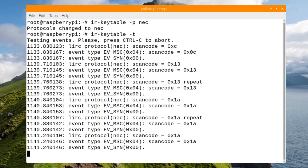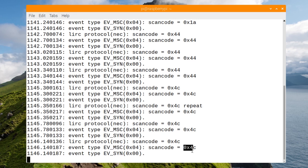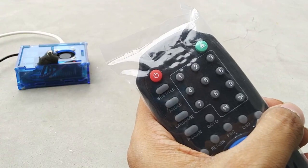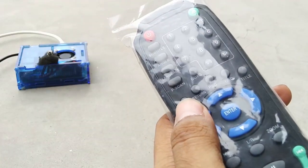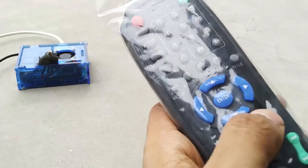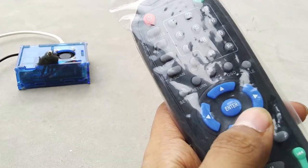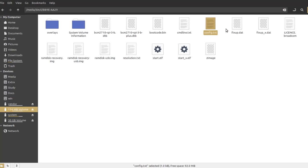As you can see in the scan code output, pressing a single key gives a hex value like 0x44, 0x01, or 0x4c. Write down these hex values in a text file or notepad and assign a corresponding key to each. For example, I am pressing the power button, navigation buttons (up, down, left, right, enter), and three buttons I have assigned as home, back, and recent apps for Android navigation. There is also a green button used as volume.